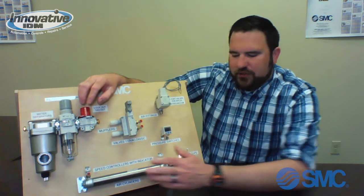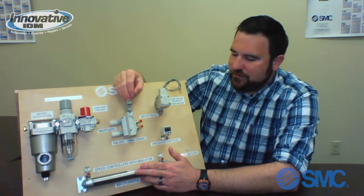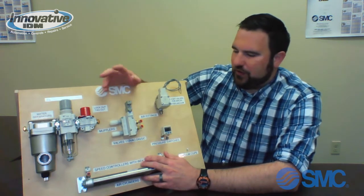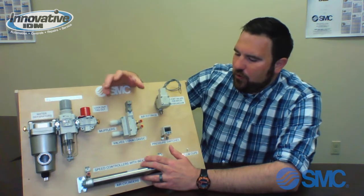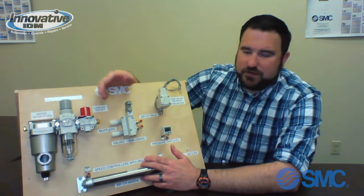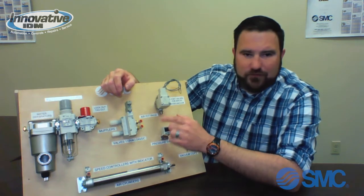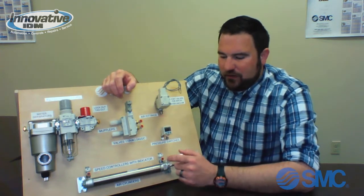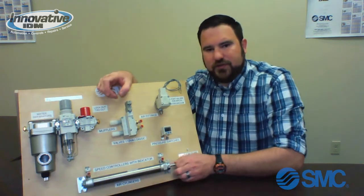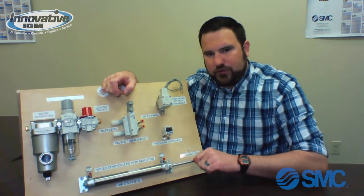So let's say the air leaves here and we're just going to do a simple cylinder setup. It comes to a valve. SMC has many valve setups — we can do them on large manifolds with remote I/O, on manifolds with different types of communication protocols like EtherCAT, whatever you need, or we can just do something like this with a simple connector. My PLC can be sending a signal — 120 volts, 24 volts DC, whatever you need — and that controls the actual valve right here. That valve is going to be supplying air to the extend or retract side of the cylinder. This is the extend side: when you supply air to it, the cylinder rod will extend. This is the retract side: when you supply air to the retract side, the cylinder rod will retract.